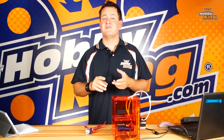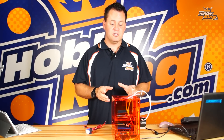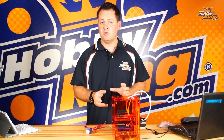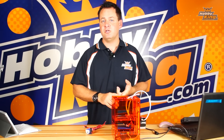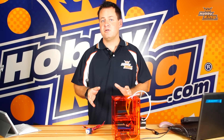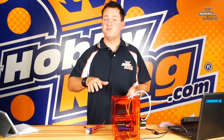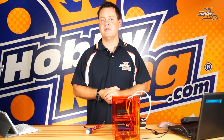The main point is that this is normally caused by a mechanical bind or extra drag in the system. It can easily be identified by looking at where it's stalling and fixing that with a little lubrication or a zip tie to manage the wiring. Over time this is natural — it happens on all 3D printers because they move so much and for such long periods of time, so they do require a little bit of maintenance.